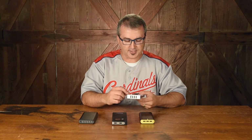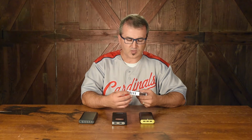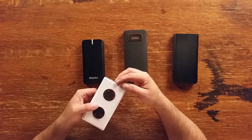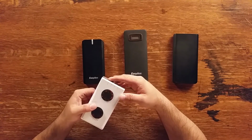They'll also have a certain number of USB ports, and in some cases they're going to be labeled with what kind of port they are. In this case, they're all 5 volt. All USB ports are 5 volt, but the amperage rates are going to differ. This one goes from 2.1 amps all the way down to half an amp.